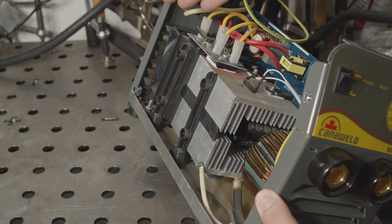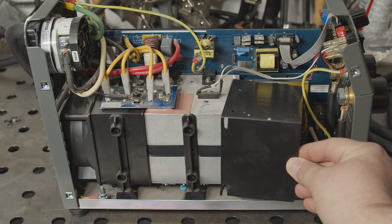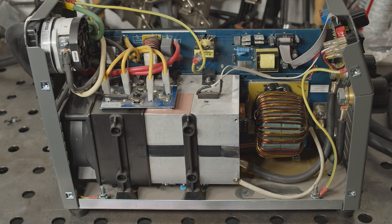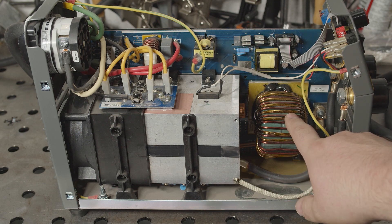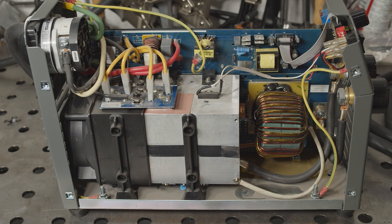On this welder, the capacitors are directly in line with the airflow from the fan. There's also this little black cover that goes right here that traps the air a little bit further down so that it all flows over top of the transformer — which is a pretty big, beefy transformer. There's also where the power comes in, an inductor and a capacitor, so maybe a little bit of filtering. I don't know if that could quite be enough to be power factor correction, but there's at least some kind of filtering coming in on the input. Pretty basic inside and out — not a whole lot to see.